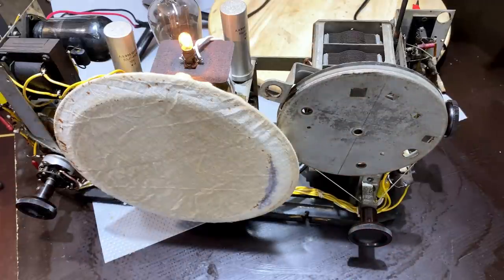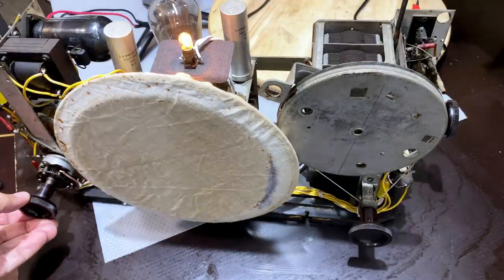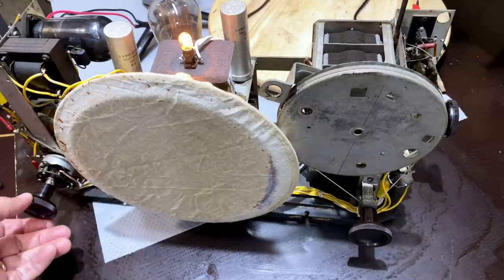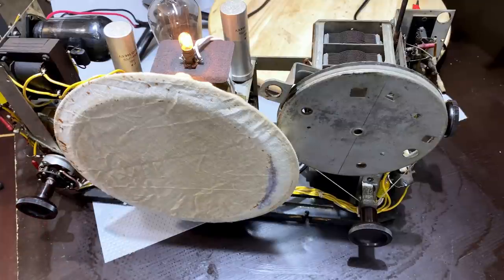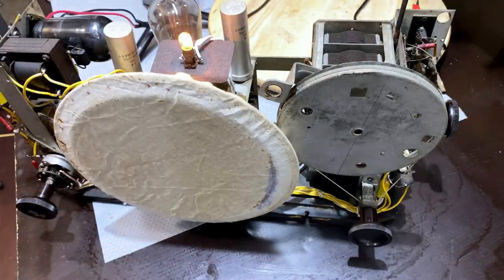You know what? It's not much, and I'm not going to mess with that little twiggly capacitor, and I don't have another trimmer to change in there, and it really makes very, very little difference. I think we've done it. I think we've done all the RF alignment that I'm going to do. I'm also not going to mess with the IF trap because that's also one of those twirlies. So as regards alignment outside of the chassis, this one is done. Brilliant.